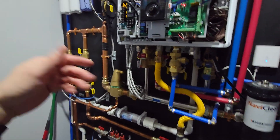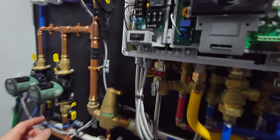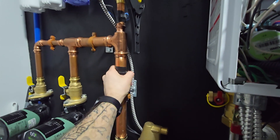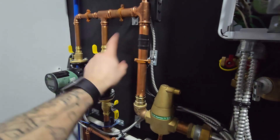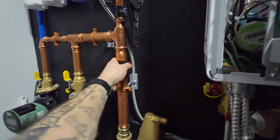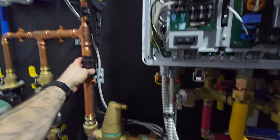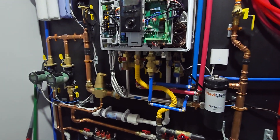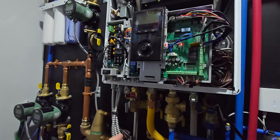For example, in this system I'm usually a few degrees off. So what you do is you mount the sensor — which I have mine right here behind this tape — it's on the back of the pipe, right up against the copper pipe. What that's doing is monitoring the temperature that's actually going to my zone pumps — one, two, three zones right here. So whatever the temperature that's actually being delivered versus what's coming out of the boiler, the boiler now knows. What you want to do now is enable that sensor so that it's looking at that and not looking at the sensor inside of itself.